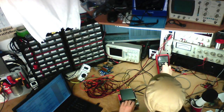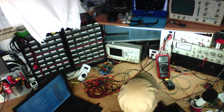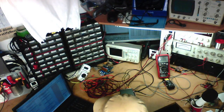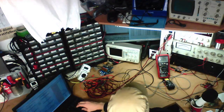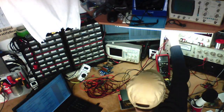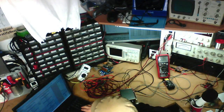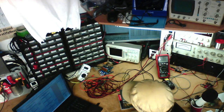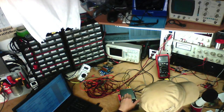Let's do the same thing for the right channel. About 8.9 volts. Loaded voltage, 8.909. Differential measurement, load off, 0.284. That gives an output impedance of 0.26 ohms, or a damping factor of 30. So both channels are matched on that part.